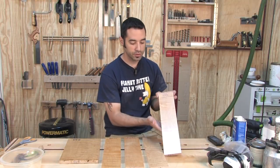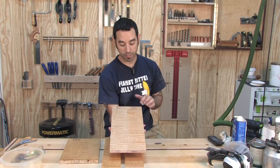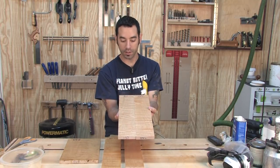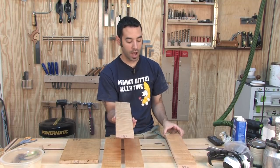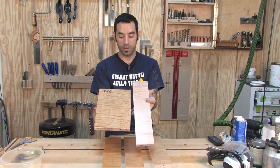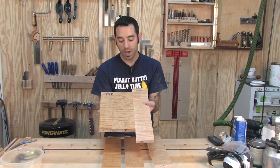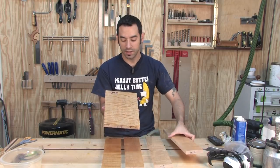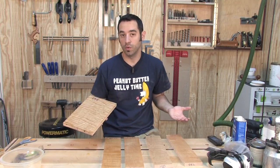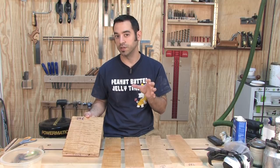The results are really interesting. Here's the oil control board versus the water control board. I don't see as dramatic a difference as you might expect — the water-based is certainly a little paler, but not nearly as dramatic as some of the other boards. The dye was a slight overshot compared to the oil, but we're in the same realm of looking oil-like. What the dye does is really pop the grain — it sits down into those absorbent stripes and intensifies the grain pattern, which gives it that oil look. Dye is definitely viable but takes more work to nail down the perfect color combination.